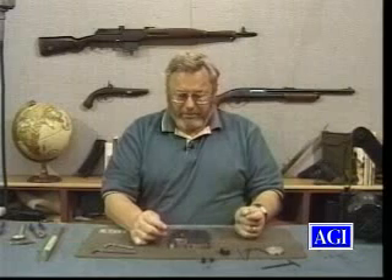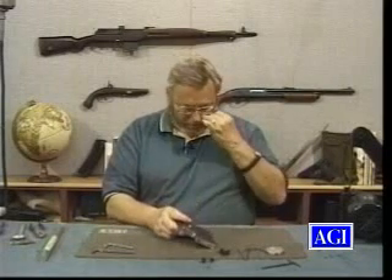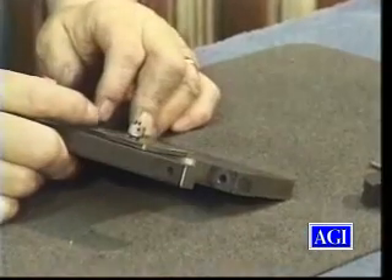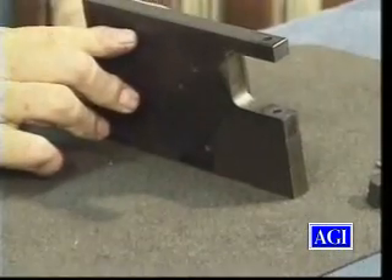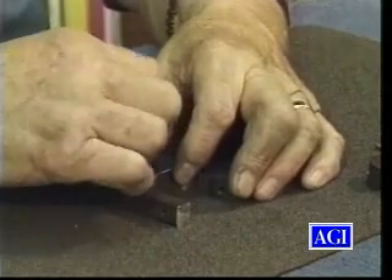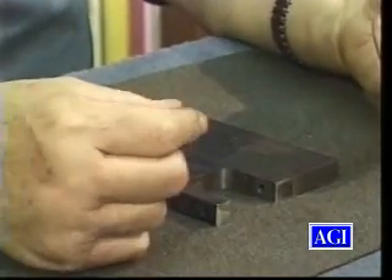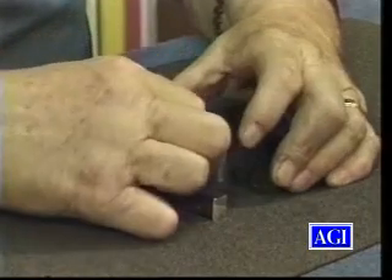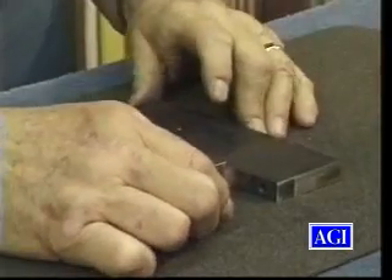It's really relatively simple. All I've got to do this — and this is not a perfected tool — but it's simply a hunk of steel. You need a little weight. I've notched it so I have room to work. Drill the hole through it so I can put an axle through it. I've taken a piece of steel and just fixed it so I can put a pressure plate on it so I can put the tension on the spring wire. And I put various fixtures in it and wind the spring wire up on it and make the spring I want to make.